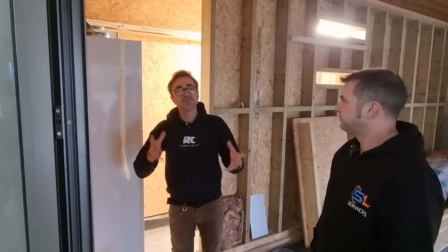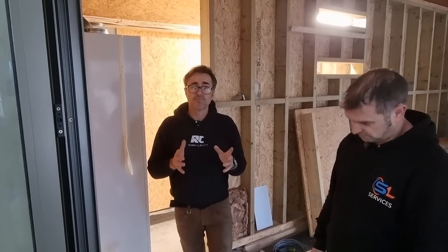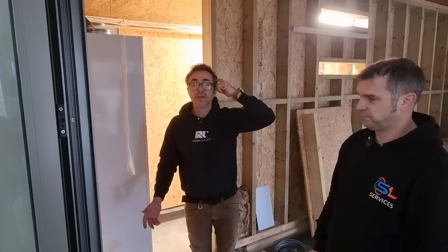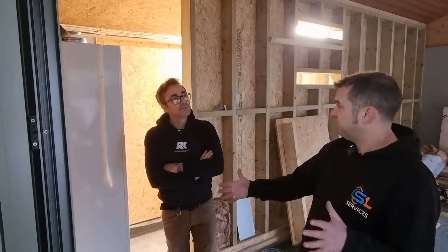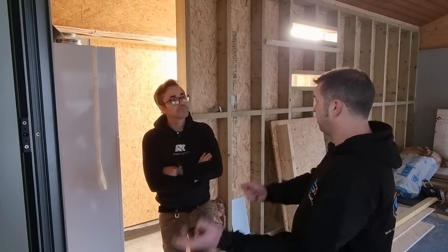People will ask in the comments: do you really need to have this? No, you don't — ventilation is a broad brush, there are all different kinds of ways of doing it. However, I like to build really well insulated and airtight as much as possible. But if you build airtight, you must get your ventilation right. The least ventilation in a new build might be a trickle vent in a window, or a passive stack ventilation system, but a lot of those are energy hungry because they just take warm air straight out.